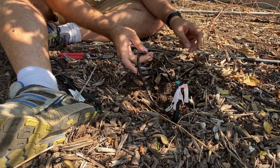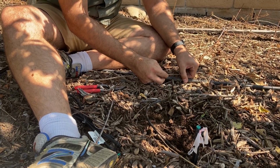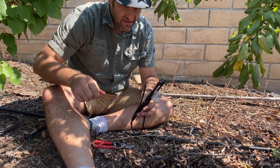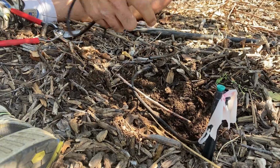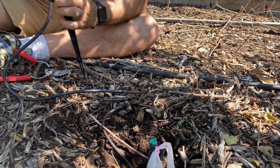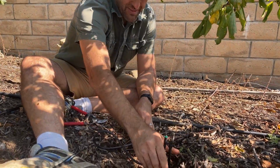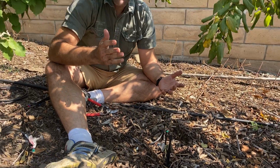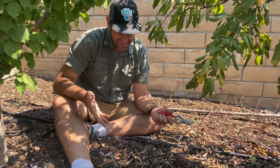Just uncover the line that you have. You can either try to unplug this from the 1/2 inch, but I don't really want to damage that or have to put in what they call a goof plug and poke another hole. I'm just going to, in line, first of all take this thing apart. All I'm going to do is, with my pruning shears, cut this line, take this new one, and plug it in. This takes a little bit of hand strength, and that was surprising to me at first. Take out this old busted one. Sorry, Kyle, for getting you with some water there. Put in the new spike. Take this here, cover it with some mulch or whatever you want to cover it. If you want to bury it, take a minute to do that. This is now going to water. How easy was that? What did it take, a minute? Less than a minute? One snip, one plug, and you're done.